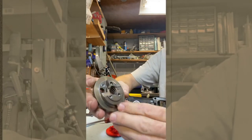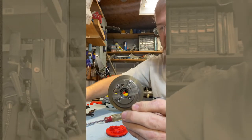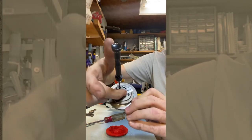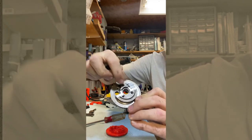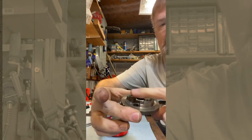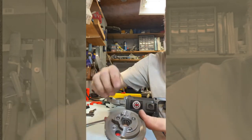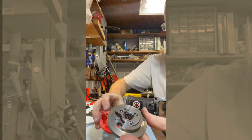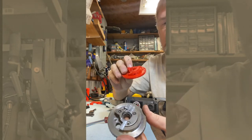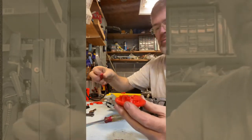So as this thing spun around there was a pin. I need to take this off to show you. Here is the gear by itself. I've made some modifications here, but initially there was a pin sticking right out here, so that had a fixed radius and therefore a fixed stroke length. I pressed that out. Then this was flush across here — you can see where I've cut this channel out right here. When I was designing this, I wasn't sure how it was all going to work out, so I modeled this up and printed it out so I could have a visual model in my mind.